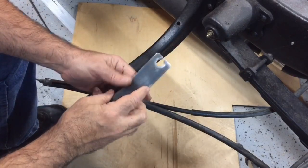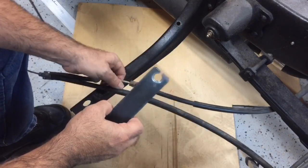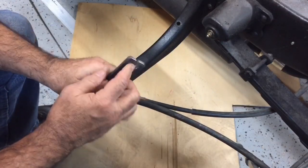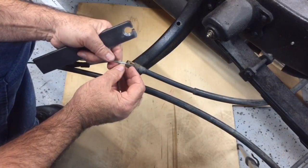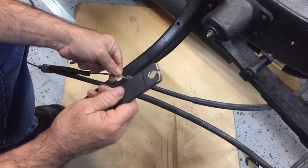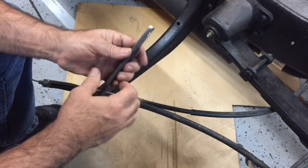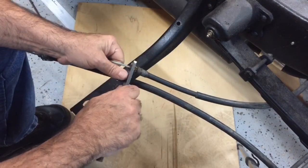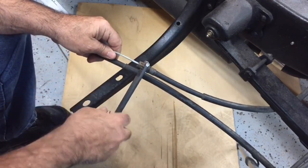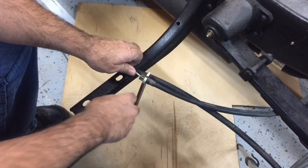I went ahead and drilled and counterbored this piece of quarter-inch thick, inch-and-a-half wide flat bar. I cut a slot in it so it could go over top of the cable and snap on. I had to do a counterbore on the back — the termination on this cable sheathing has a little more than an eighth-inch grip length and it's a quarter-inch thick, so I had to use a counterbore to make that eighth-inch thickness. So this slides on and snaps on, keeps it from coming out. I'm going to bend this up like my CAD drawing. I left it a little bit long so I can clamp it in place, do a trial fit, and get the position right.